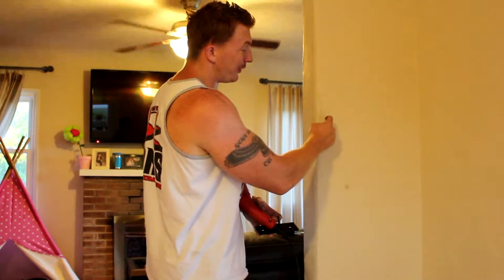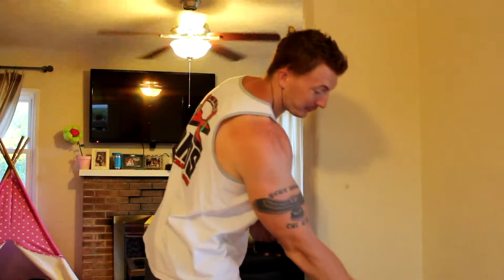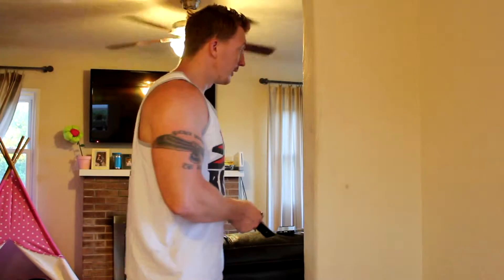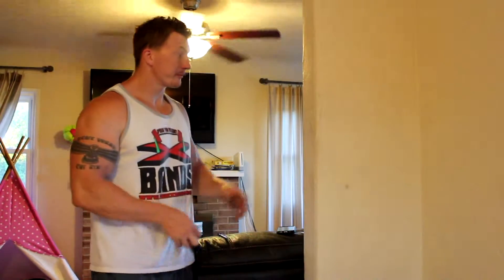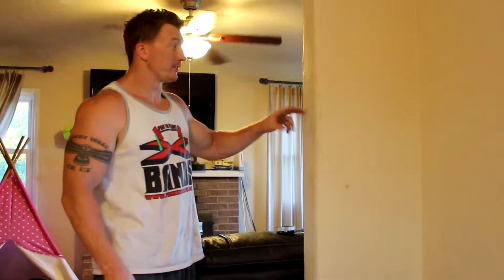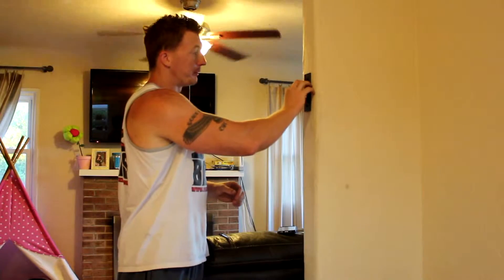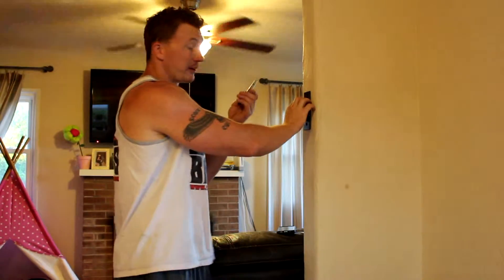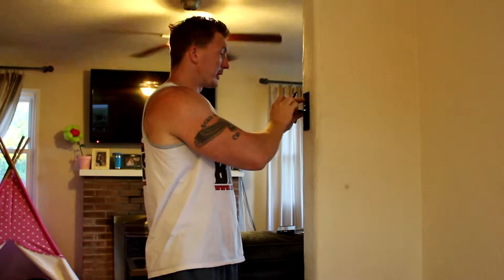You can poke a little hole through the drywall and you'll find your studs — it's the old-school way everybody's done before and you just patch the holes up with whatever you want. I'm going to put mine right here on this wall. I know there's a stud right behind here just by the way it's framed up. I'm going to put it right about shoulder height. Take a pen, pencil, or marker and mark your holes.